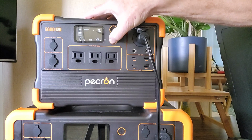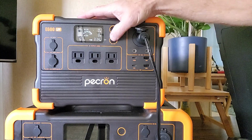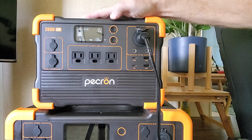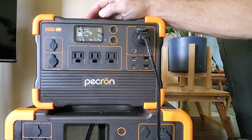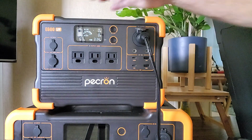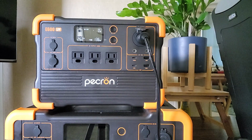And then it's got the AC out button. And with that on, I have 31.4 hours left. That's probably going to readjust pretty soon because nothing is draining it except itself. I'm going to shut that off. Oh, I know. At 67%, it'll run 31.4 hours. So solar charging at the same time as running an appliance would allow me a lot more time. I'll test that later. It also comes in at a respectable 26.2 volts.